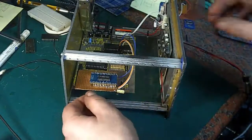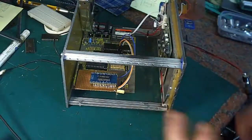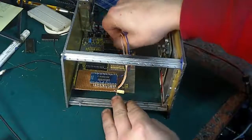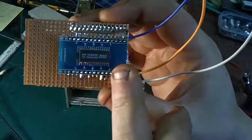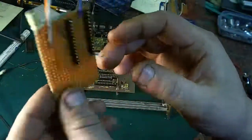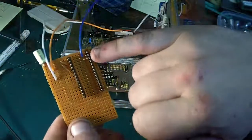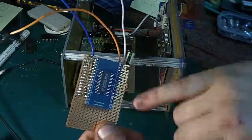I've basically done exactly the same thing and mounted it on one of these little TSOP-to-DIP package boards. This is an entirely plug-in upgrade to the ZX81 — obviously it wouldn't work with a ZX81 in a case, but when you've got a ZX81 built into something like this, space isn't an issue. We've got the 32K TSOP package soldered onto the adapter board. I've just used a piece of matrix stripboard here. That goes into the old RAM socket — it would have been originally a 24-pin, but I've got a 28-pin socket fitted to the Zeddy.